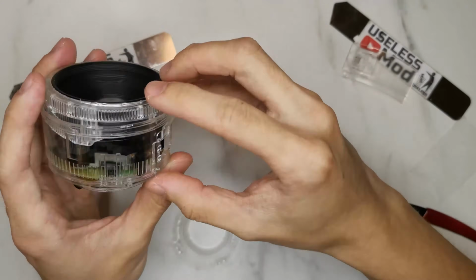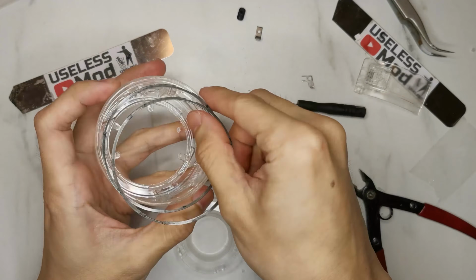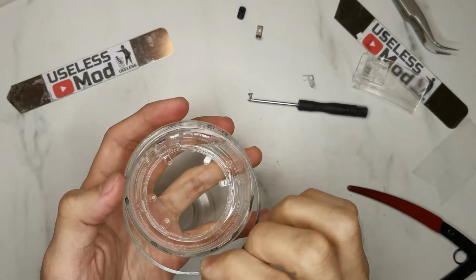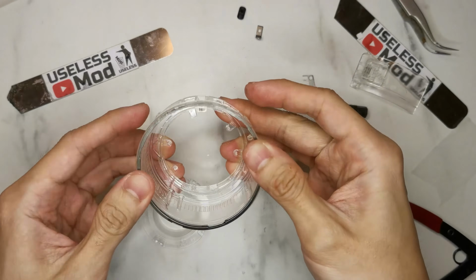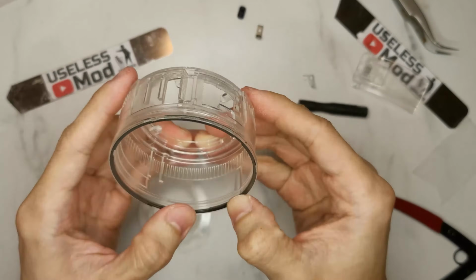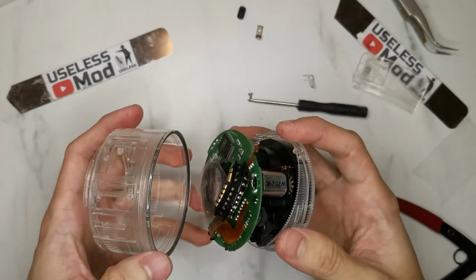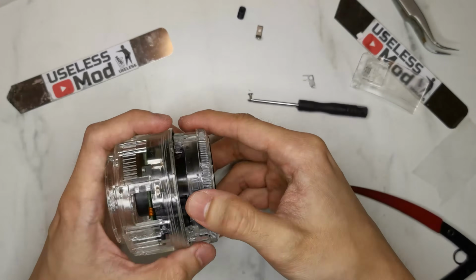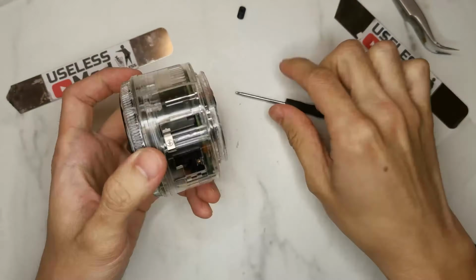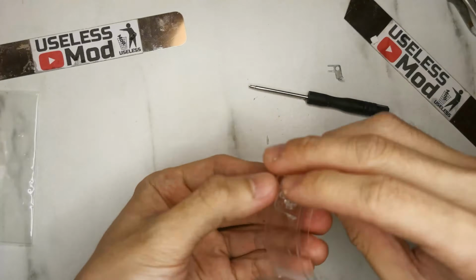freely. Now try to put back the outer case, but find out without these two metal rings, the whole lens will fall apart. Since the casting will shrink a little bit, the metal ring is a bit difficult to fit in. After heating it up a little bit to soften the epoxy and doing some trimming of the epoxy, finally I put the metal ring back inside and then put the retention clip back to the main case and the manual focus button.